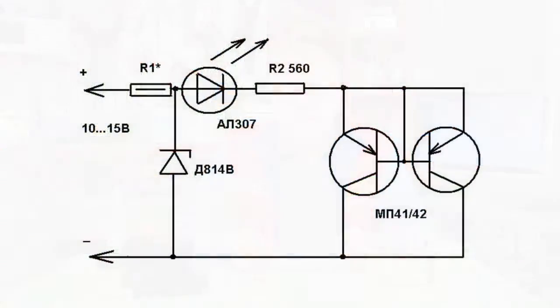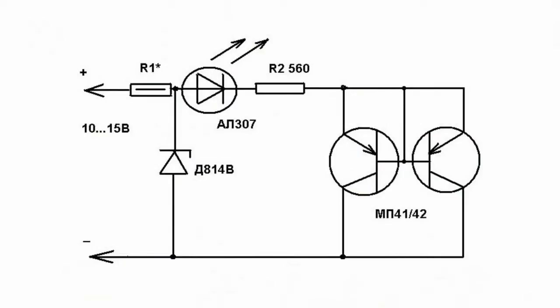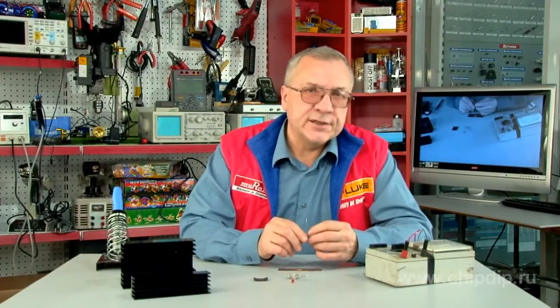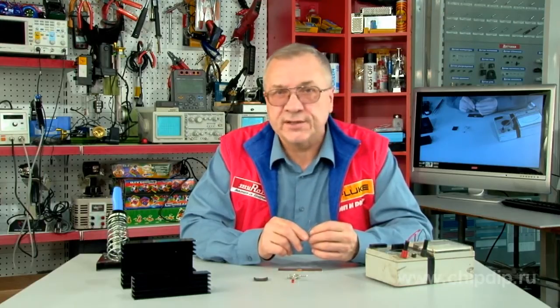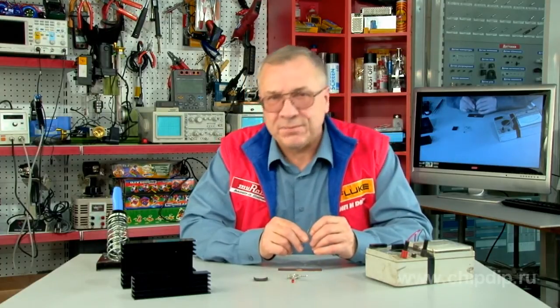The sensor must be placed directly on a heat sink. One of the variants of such a sensor is a heat sink or heating indicator using germanium transistors. A germanium transistor has unique amplification characteristics. Apart from that, it can react to temperature changes on a heated surface. One of the parameters we sometimes have to pay attention to is the collector cut-off current, which appears when the source is connected to a collector junction in the reverse direction.